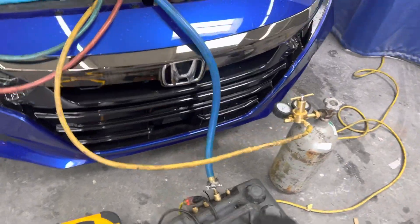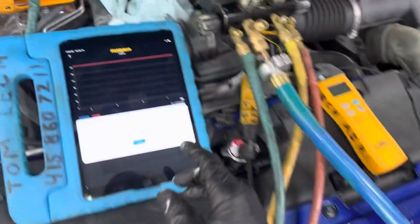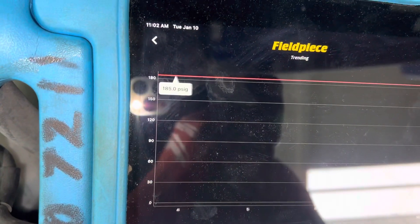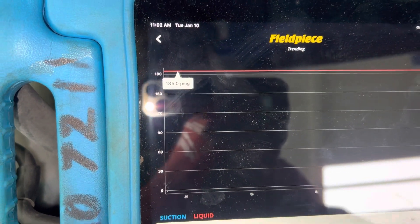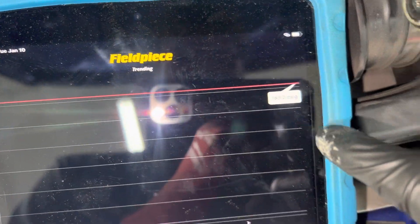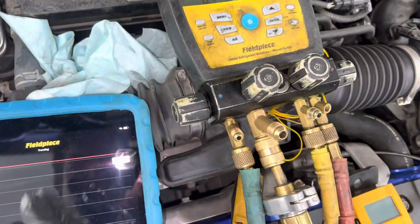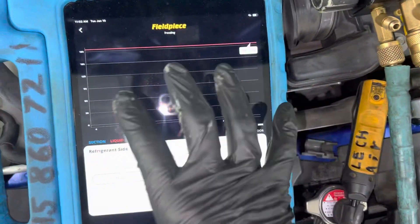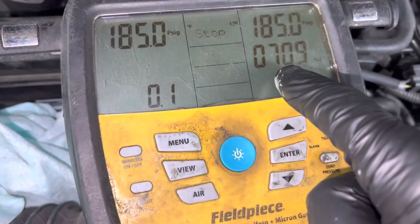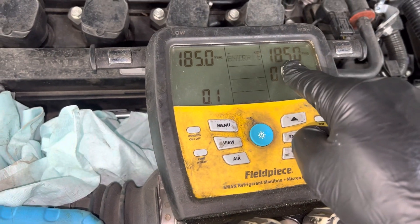High pressure nitrogen decay test — brand new condenser installed, checking for leaks. Starting on minute four, we're at 185 psi. Going into minute eight, still at 185 psi, as indicated on gauge two. The software lets you data record and make a copy of the pressure test to prove it. We're seven minutes and ten seconds in at 185 psi.